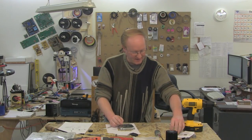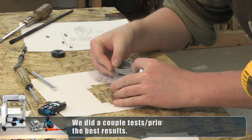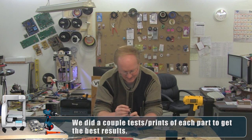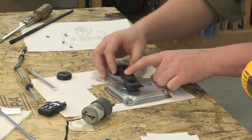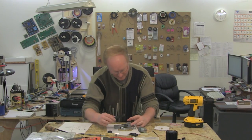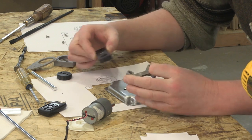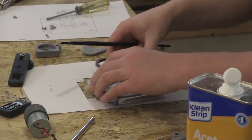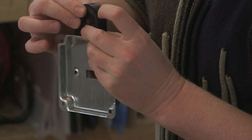The parts are going to be the motor mount — this will mount a gear motor beside the box. The gear motor will have a wheel on it, and the wheel will have an additional peg that will rotate the arm. The arm will move up and down, hopefully activating the light switch. We also have the arm guard, which will keep the arm from lifting up too high and mounts right over where the standard screws are. We have a better version of the motor mount printing right now. Got the other half of the motor mount — I'm going to glue it together with acetone. I made it in two parts because there would be overhangs that I couldn't easily put supports under, so I just made it in two parts.